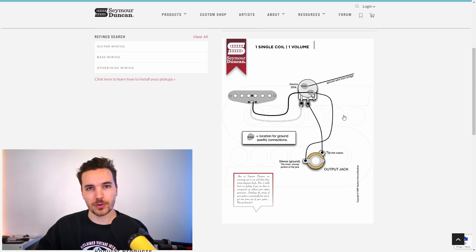If I go to the configuration it will be after modification — one single coil, one volume — you can see it's a much simpler setup. Including the ground wire to the bridge shown in this diagram, it's only five wires and there are no capacitors. I'm removing 10 wires, a capacitor, two pots, and two pickups — so it's a lot of stuff that will be gone.